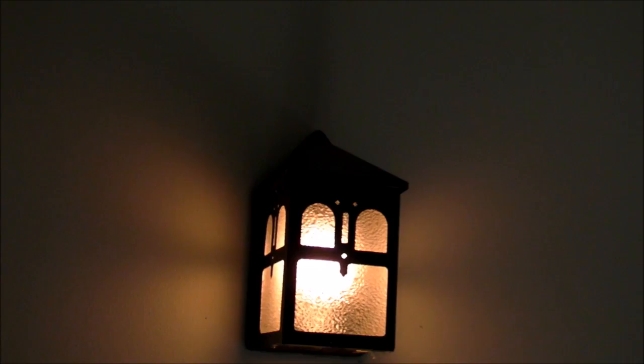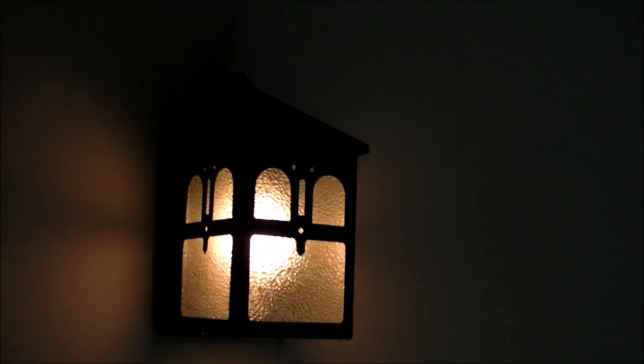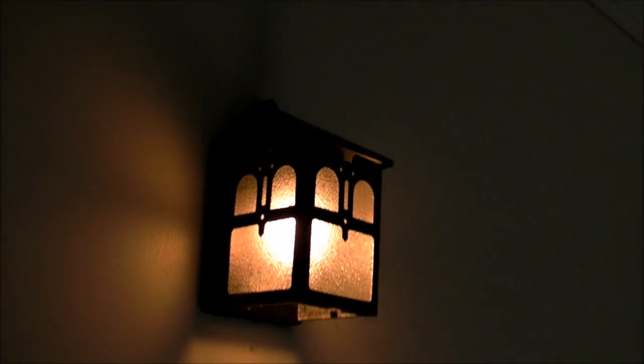It's a small building with four individual apartments and the only lighting inside the main entryway is just the small lanterns outside each tenant's door — that's mine up there in the top right. Inside is a 230 volt 25 watt incandescent lamp operating on only 120 volts, so it's getting half its voltage and dissipating only about one-third of its rated power — closer to one-third than one-fourth because an incandescent lamp is a non-linear resistance. At half its rated voltage it lasts very long; this one has been here for about three years.